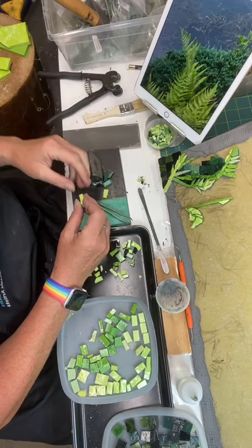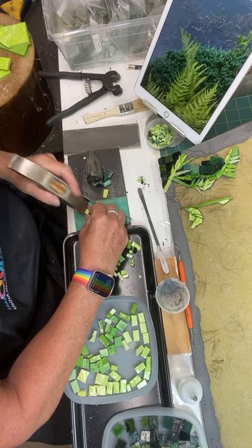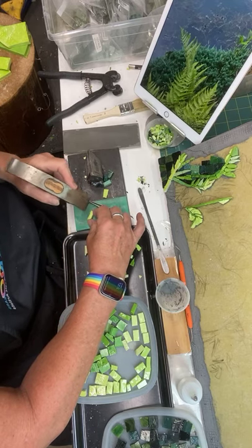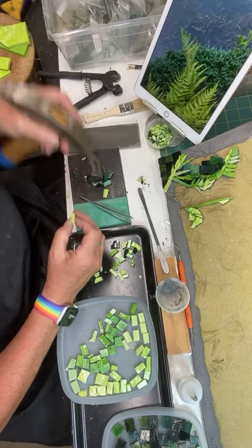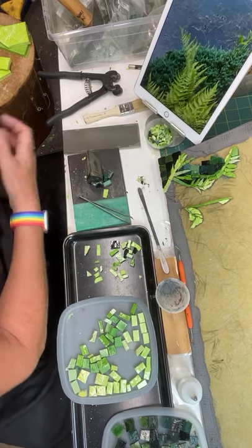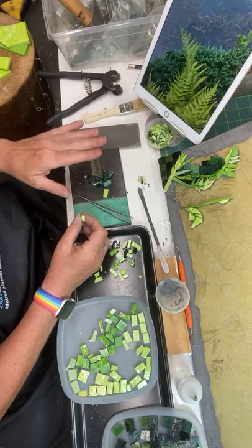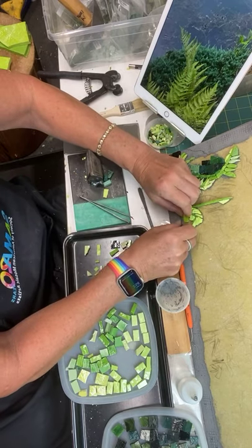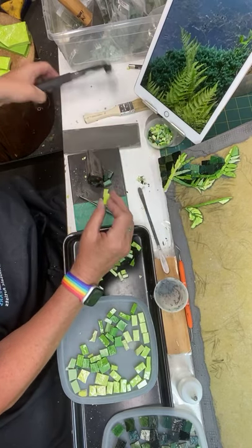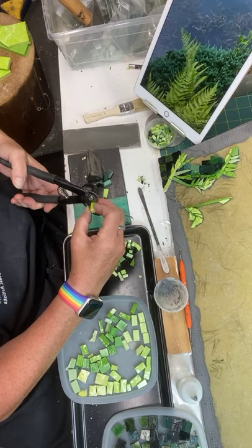Not the best of cuts, but the cool thing is then I choke up and you can nibble at it. Unfortunately, my hardie, excuse me, my regular one, is not at the right height. I'm working on that, and I'll get it in the next week or so. But because it's not at the right height, I'm having to use this one or rotating, and it's just not working right yet. So I'm not getting great cuts with my hammer and hardie because this is just too high. So I had to cut this down in height, and now I'll hold it up and visualize, and since I'm not using the hammer and hardie the whole time, I can use my nippers.